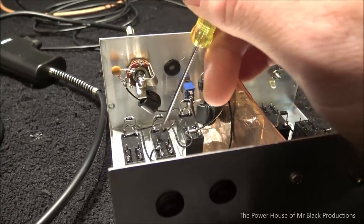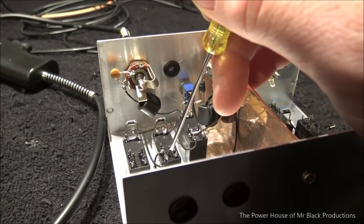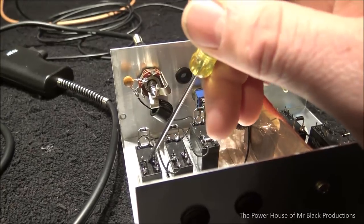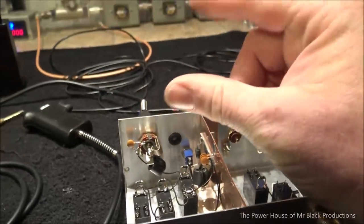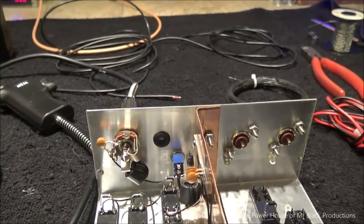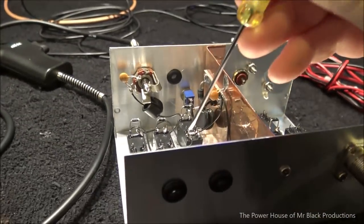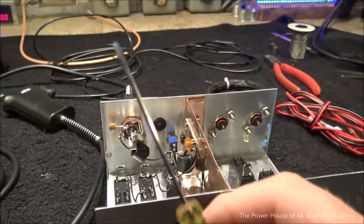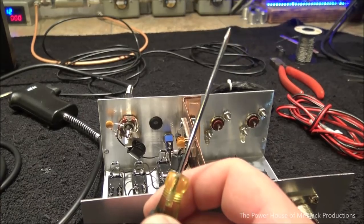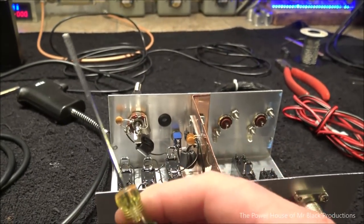So now we've built in a latency, an amount of time to allow the receiver to fully terminate in the VFO inside the Icom, letting it spool down, putting the Icom into transmit, and then we can bring the 955 on, which will help isolate the receive. Now, listen, the receive on the Icom has got a bunch of protection to it, and the chances are pretty slim that we're not going to be able to overload the automatic gain control circuit in the Icom. But the goal is to make it completely seamless. So when we're over here receiving, click to transmit, and then come out of transmit, there's no exterior RF other than the receive, so the AGC doesn't have to play catch-up and try to overcome.